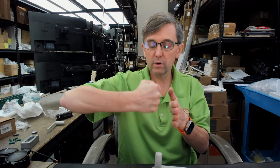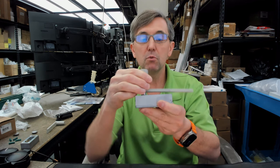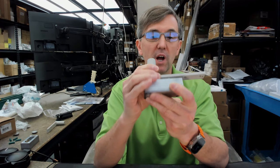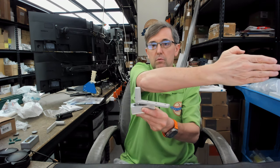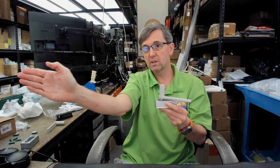So you don't need to radius or round over the door at all, because the door is coming closer to the jamb, but it's moving out very quickly. And by the time you move it just a small degree, as soon as you start to push on the door, it will have the door cleared enough from the jamb to where it can continue to open.